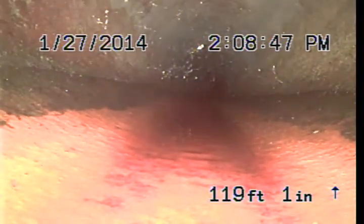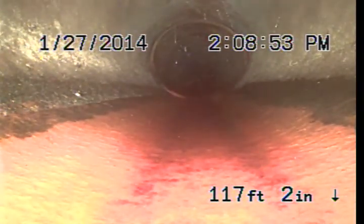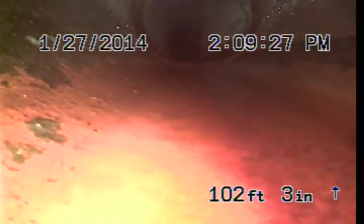Pulling back, we see this is a clay pipe. Clay is a very resilient pipe for any form of chemicals or water that goes in a system like this. It doesn't corrode or oxidize, and it won't erode or deteriorate over time. What clay does do, since it's not a flexible material, is that if it's exposed to an excess, such as heavy root intrusions getting much thicker, or heavy earthquakes, a clay pipe won't flex. It can crack if it reaches its tolerance point and goes over it.